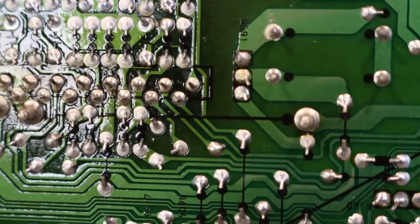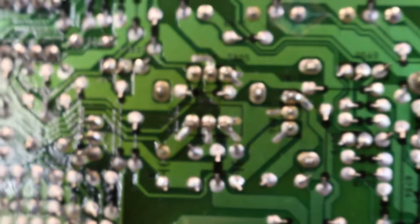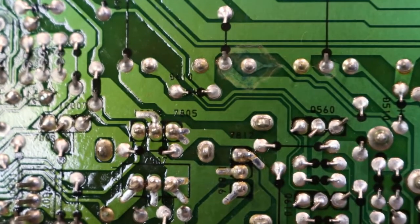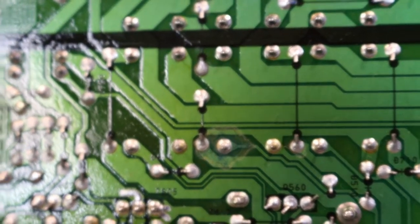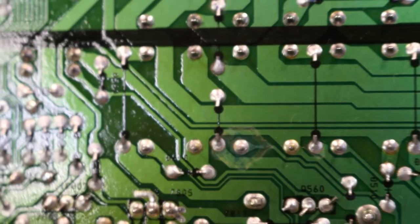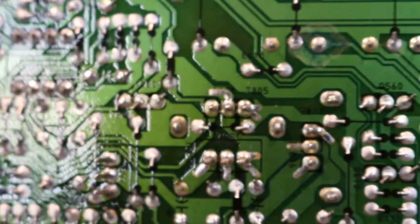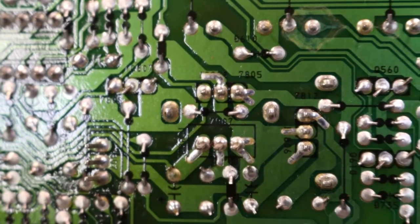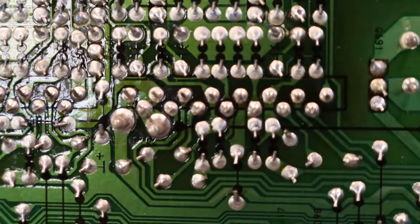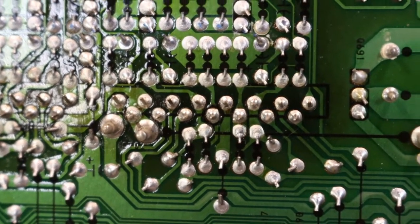Further up the board, this is around the power section. The 7805 - the pins on these are not looking the best. It actually looks like a little bit of corrosion or something there. And those are the relays - you've got four pins at the top for the contacts and two pins in line with them down below for the coils. You can see the coil sides are not too good - there's definitely cracking around the solder joint there, which is a dry joint about to happen. Here are those regulators which run quite hot - they're on heat sinks - often a sign and cause of expansion and contraction. Now here we are on one of the driver chips that feeds those output transistors - you can see the pins, especially on the left-hand end, are pretty bad. That's a common cause of intermittent channel dropout on amps.